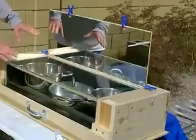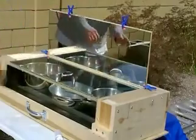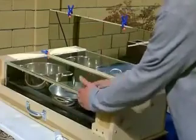Now let's install the glass. You might notice that I didn't slant anything — everything's a rectangle. All the pieces of wood are rectangles, the glass is rectangles — no slants, no curves, no triangles. There's no sense in slanting it and having a pan at the bottom where half the heat sits above the pot and escapes through the glass.